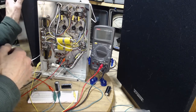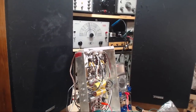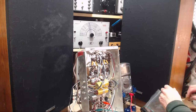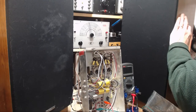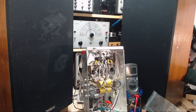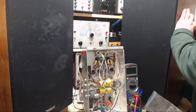Okay. Now disconnect this guy here. I'm really intimidated with these gigantic speakers standing all the time. My ears keep whispering, "I'm gonna blow us off your head at some point." Okay. This one out. Huh? The hum is gone. It's a single channel hum. Well, that's a big deal.